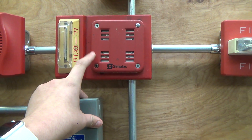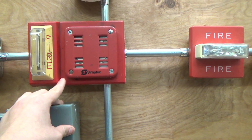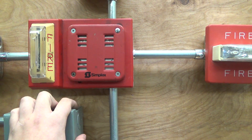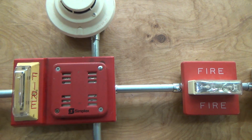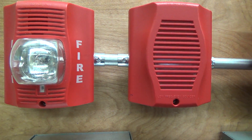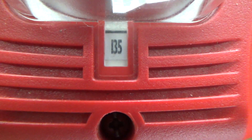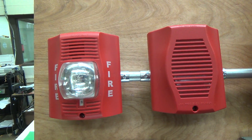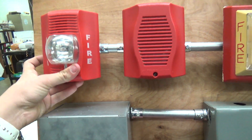One of the main reasons I brought this in was because it's cool to show what came out of the school — it's pretty much a broken alarm that I was able to clean up and make look good. I can't even tell you how dirty this thing was, coming out of the metal trade shop with metal shavings everywhere, just black on top. Right here we have System Sensor sync. These two alarms are both Advances — this is the low-frequency sounder and this is the regular Advance, set on 135 candela. I decided to do syncable alarms to show how neat this panel is, and having a two-wire device with just two wires going to it and being able to sync them both together — I think that's pretty cool personally.